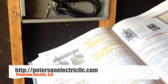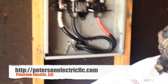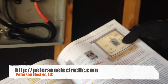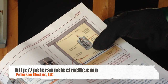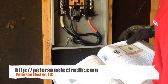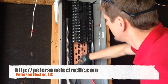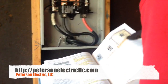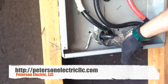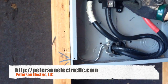We have other things that are also called — here's our grounding electrode conductor as it comes up. Here's our main bonding jumper; it's going to tie your neutral and ground together. My inspector didn't really care for that, but in order to size that I'd probably be okay to come off with a number 6. But the cabinet is already picking that up through this. He did talk about my bonding bushing, as this is a raceway coming through. I don't have PVC — I have a metal nipple in there, so I have to bond it with a bushing because it disconnects on the backside of the meter.